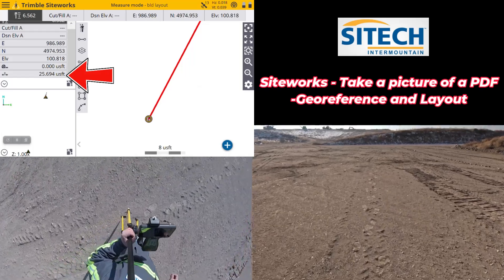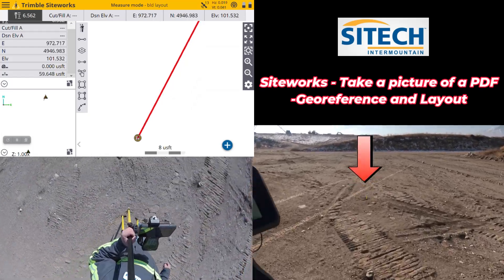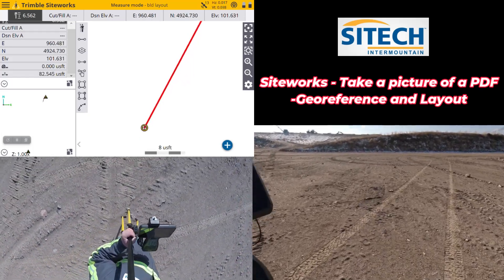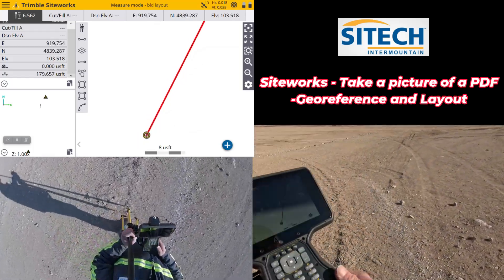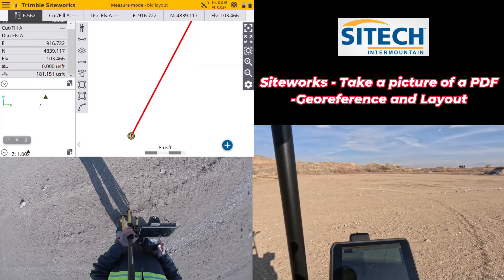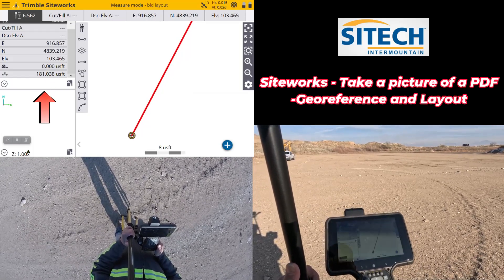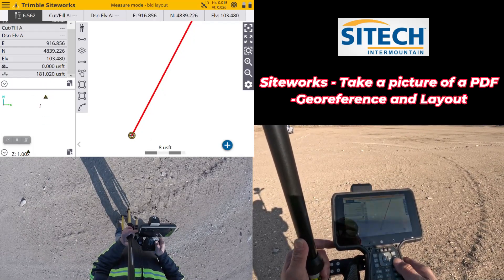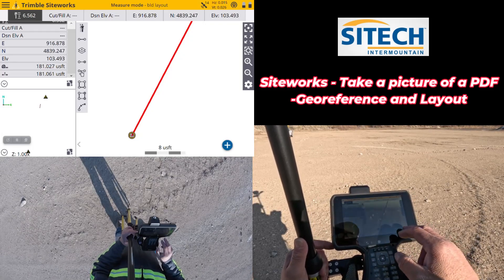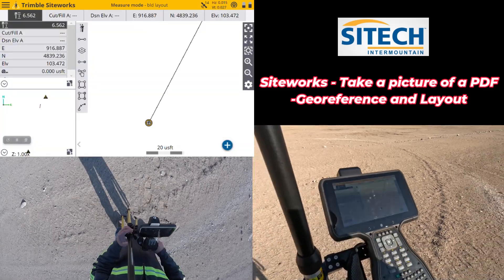I'm going to use a feather out in front of me to give myself an alignment for the face of the building, so that when I georeference that image it lines up correctly. You can see the feather is way short of 181 feet — it's just something to eyeball. Once I'm getting close, I'll turn back around, eyeball between those two feathers, and walk to 181 feet. I need to come back just a little bit and level up. Once I hit 181, I'll take my shot. Now I'll hit menu and measure to cancel out of the line string. I've got a line established which is going to let me georeference that image.